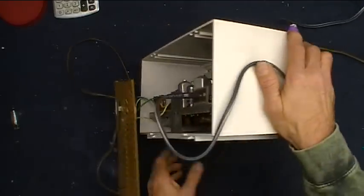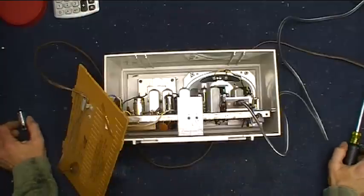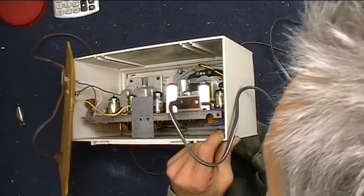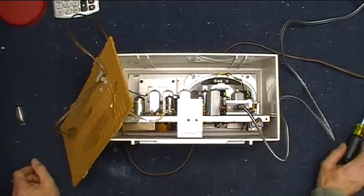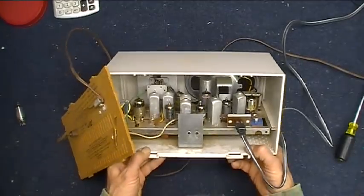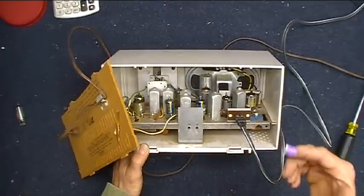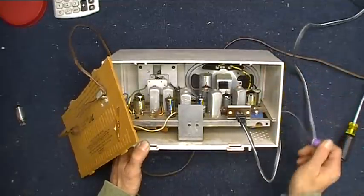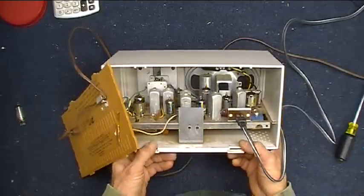There's a basic idea — how to troubleshoot vacuum tube stuff. So I'm going to go through here and see what else might be wrong in some of these other tubes, and eventually get this thing working again, because it was kind of a nice radio to have in the shop. It's been in a few videos — I used it in the FM transmitter bug video, and it's got a really cool sound. If you get into the back of any of this stuff, again be very, very careful. If you're working on any big audio amplifiers with large transformers, you want to be really careful — there's upwards of 300 volts floating around in there. They can kill you. Electricity can kill you, and it can also serve you well if you treat it with respect.